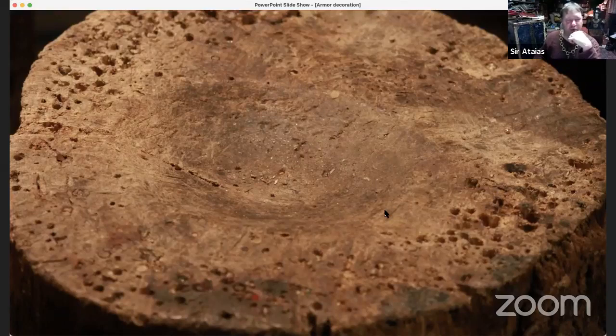Nowadays, if I want to dish a smooth, clean surface that I don't want to mark into that dishing stump, I would lay down a piece of soft leather, or scrap leather, to do that with. Because marks, even from straight pieces of metal, will transfer to your metal.